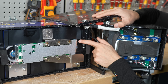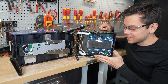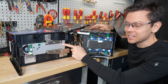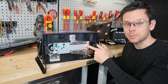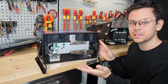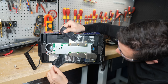These massive bus bars and steel cell holders probably cool it down even more, which is probably why I could pull 200 amps for a full capacity test — that was impressive. Functionally the cheaper battery works great and I've done lots of testing on it, but when you step up a hundred bucks you get quite a bit more. I thought Watt Cycle would dumb it down with a cheaper BMS for this first large dumb version, but no — this looks fantastic. This is the same build quality as all their other models, and look at how big these bus bars are. This thing is so overbuilt it's crazy.